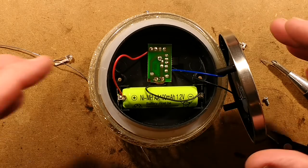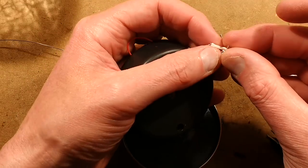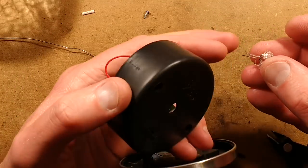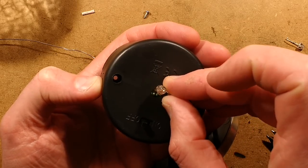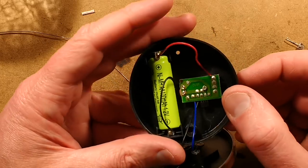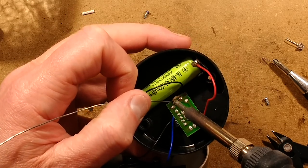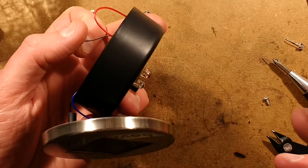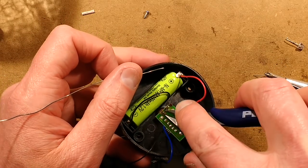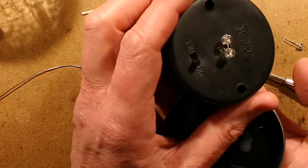Now I'm going to get my replacement LED. I could use the original as a spacer but I don't think I really need it. Where's my positive? My positive is at that side. I'll pop it in so it's just barely sticking out — that looks pretty good. I got engrossed in the project and forgot to eat. They're still square — doesn't really matter, I can squish them about anyway. Let's crop these leads; I'm very confident. If I turn that on and cover the solar panel, both those LEDs should light up.